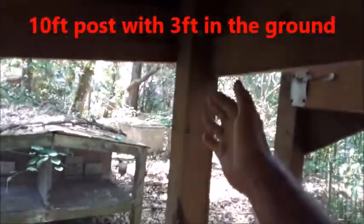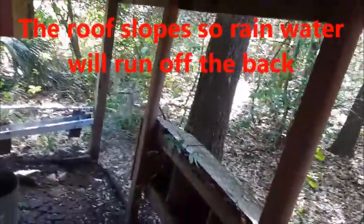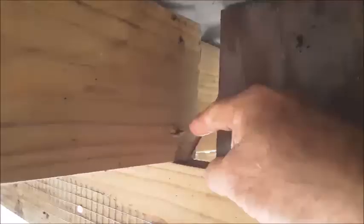You're basically going to line up a row of 4x4s. We did use some yard timbers initially — I wouldn't recommend it though, as they don't have as good a pressure treating as 4x4 posts. You probably need about a 10-foot post on your front corner, and we got down to about 5.5 feet tall in the rear, so an 8-foot pressure-treated post works there. For a span of about 12 feet, we have four posts in a row with a 2x6 running down the length. Put 3/8-inch bolts through your post into the 2x6, then run 2x6 stringers across spanning about 8 feet, screwed right down onto the beam.